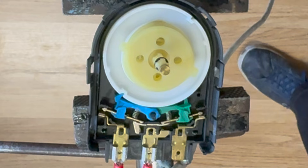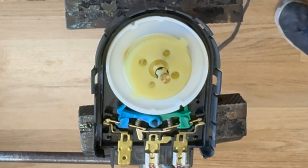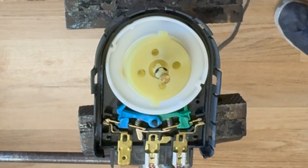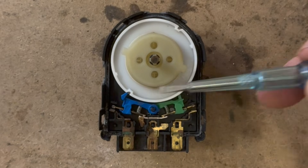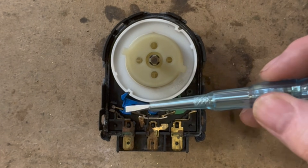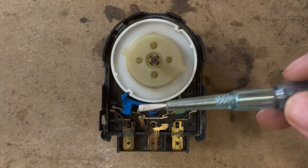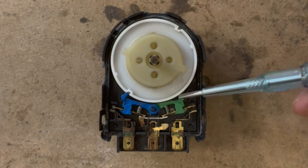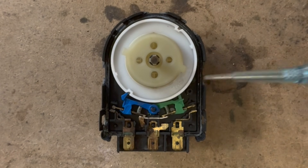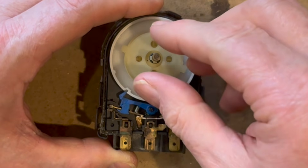On the green switch the two connections are touching, so if you put power on there it will make it work. The white cam is continually rotating anti-clockwise, it misses the divot that turned the blue switch on, and then there is a lower divot where the green switch latches in, turning off the power again. This means wherever the motor stops, it stays in that position until you call for the opposite action. If it stops in central heating it stays there until you open the hot tap, at which point power goes down the opposite leg, moves it around, and when it stops it stays in that position again.